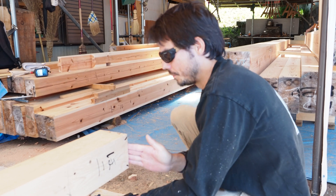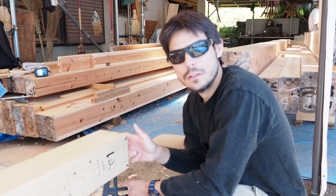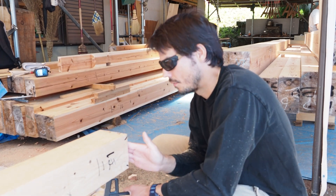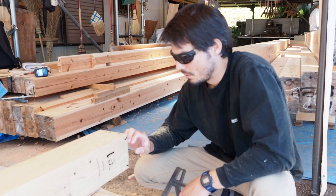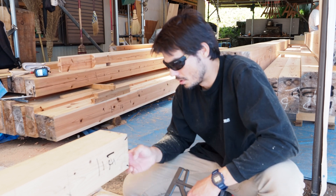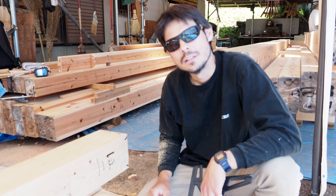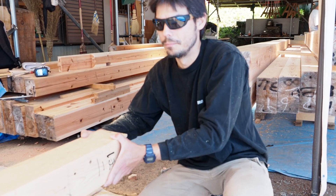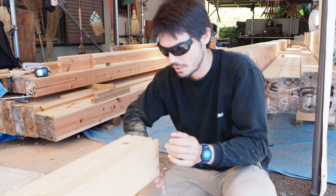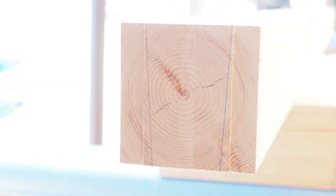It's a pretty clean cut. Normally if it's sticking out too far you can just take a planer and flatten it, but this is perfectly flat. Now that I've got my primary cuts, what I'm going to do is take my noko and try to cut it on an angle to remove more of these pieces off. But first I'm going to take a sashigane and make a mark at the actual angle of this dovetail, and that way I'll have a guide for when I do the noko.